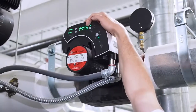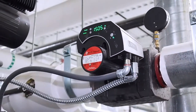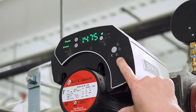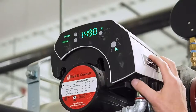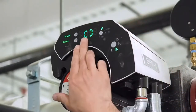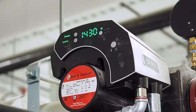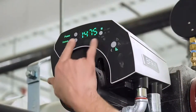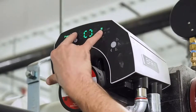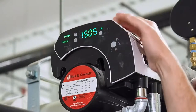What we're reading right here is that the output is 1445 to 1460 watts as it keeps changing based on the signal being provided by the boiler. The boiler is telling it what speed to run at with a 0 to 10 or a 4 to 20 milliamp signal — it can take either one. If you press a button on the HMI, these two brackets being close together indicates the HMI is locked right now. We can unlock that by pressing the up arrow and the parameter button at the same time and holding it until the brackets open up.